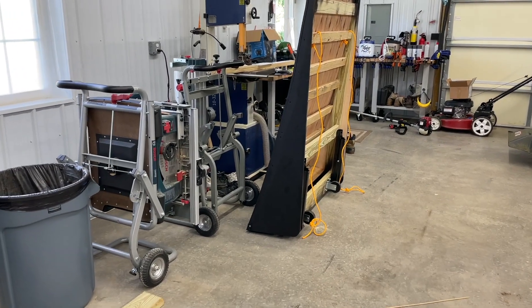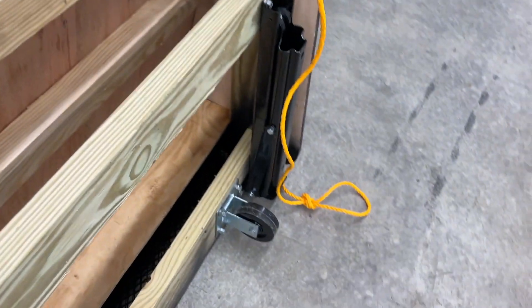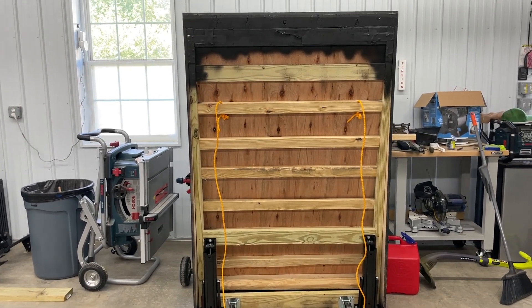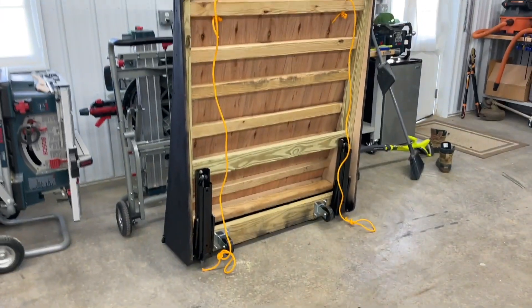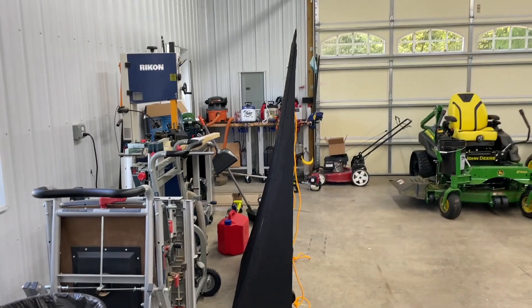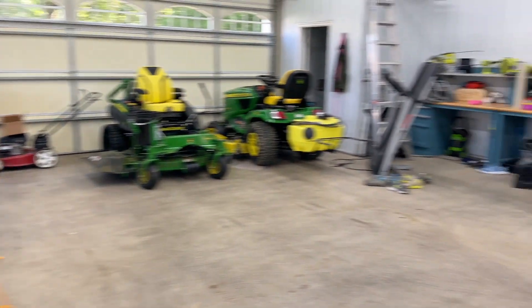And just a final parting shot — here it is standing up. It'll stand up on its own quite nicely, but if you want to kick these legs out at the bottom, they'll come out and give it even more support. There's a look at the underside — one piece plywood with supports approximately every six inches. The ropes are attached through the bottom, just to let one or two people drag it across the yard on its casters. Thanks for watching everybody. I got a lot of ideas from your ramps and wanted to make my own, taking some of those ideas with me. Happy bashing.